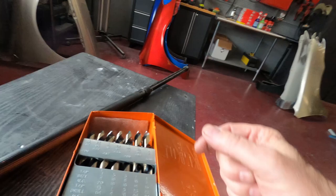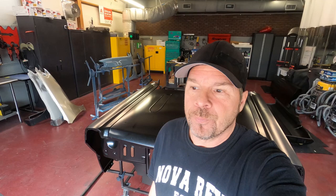So what does that do? It does two things: it keeps you from having to drill a pilot hole to locate your bit, and it also produces less heat and less friction on the blades, because as one notch breaks through to the next it changes blades for every step. That's why you can hammer on a step drill so hard. When I'm drilling a half-inch hole, I don't have to start with an eighth-inch pilot then go to five-sixteenths — it's one step at a time. My bits last longer, and it saves me time. I'm a big believer in products that save me time.